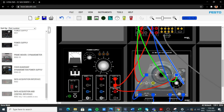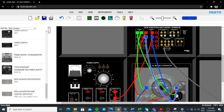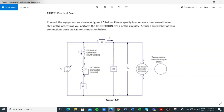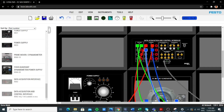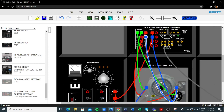So this is the full connection. From terminal one from the voltage source, connect it to the negative terminal down to the armature. Then connect the parallel counterparts — E1 connects here and here at the armature. This junction also uses terminals five, six, seven, eight, then goes to I2 and through here. That's the complete connection.